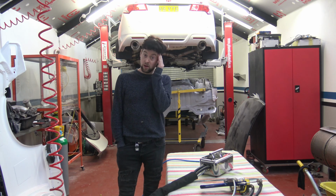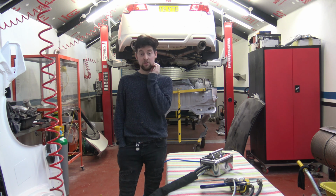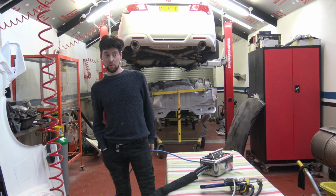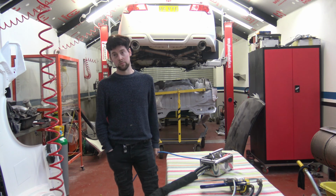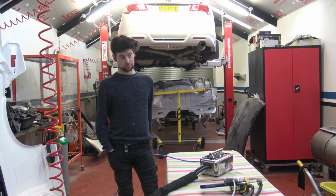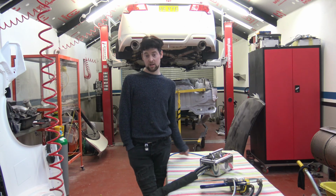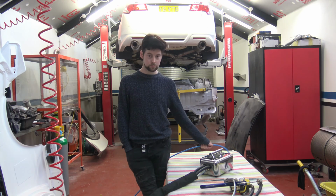Many people have chopped high voltage transformers that power the magnetron of microwave devices in the past for DIY welders. I have done this in the past too. I've done this probably 15 years ago, but it tends to be ineffective and not very efficient for a project like this, considering the distance between the transformer and the clamp and the electrodes.